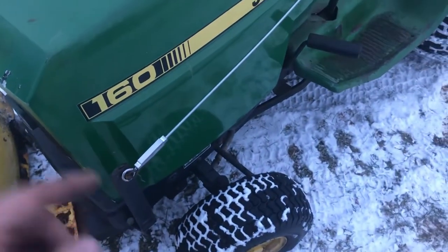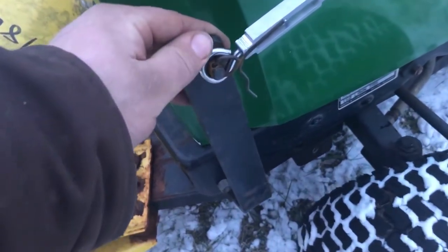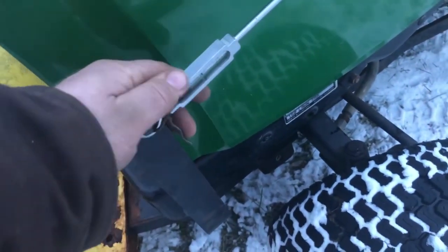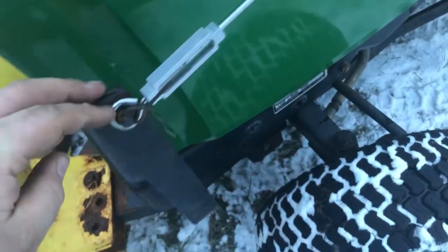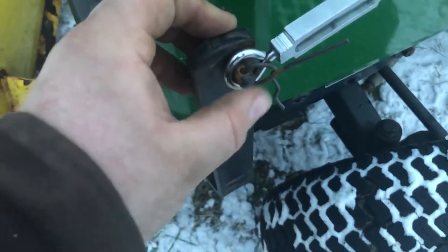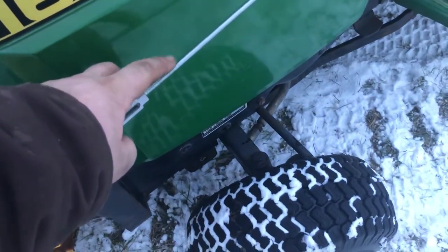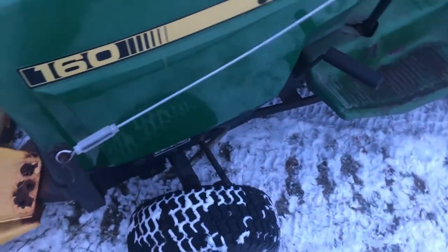This lift link was the part I didn't have. On this end it's an eyeball — I made this out of Home Depot parts. There's a turnbuckle — be aware: one of these holes is right-hand thread, one is left-hand thread. This is the left-hand thread, but it comes through this pin here, cotter-pinned to hold it on, and then it's a two-foot piece of threaded rod. It just barely works — it's almost too long; could easily have been a 23-inch piece.